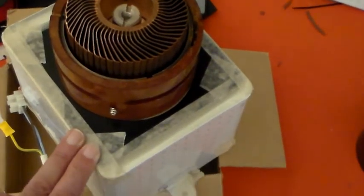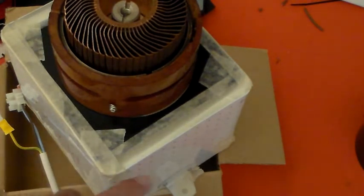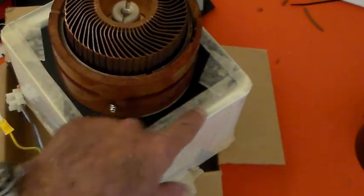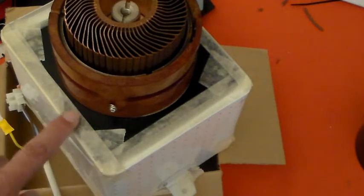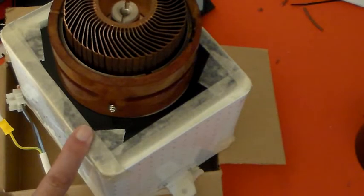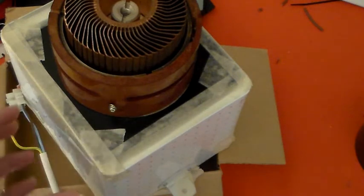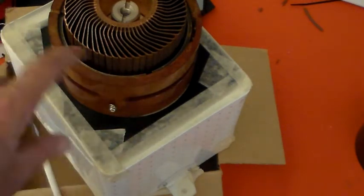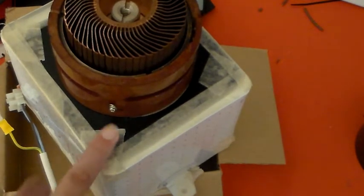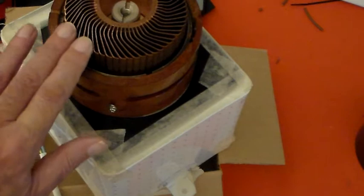If it does, it's going to be a case of trying to improve things. I know it's an axial fan and they don't do terribly well with back pressure. It's blowing into this almost square — actually rectangular — box, which causes a lot of turbulence. So I'll try to improve the airflow by putting a cylindrical arrangement inside and tidying the airflow up, to get more of the air to actually go through the valve.